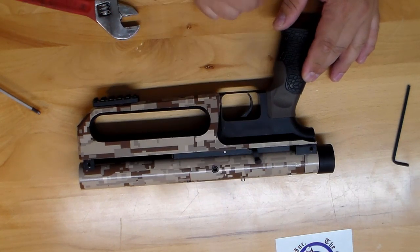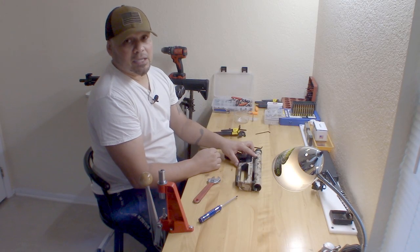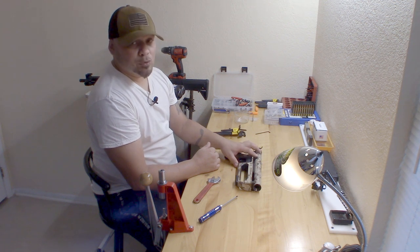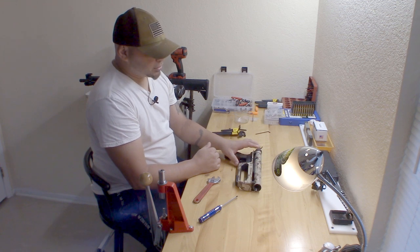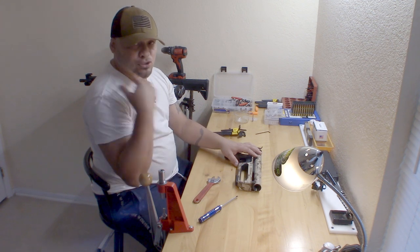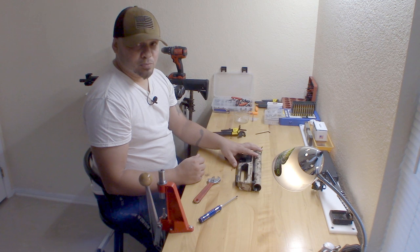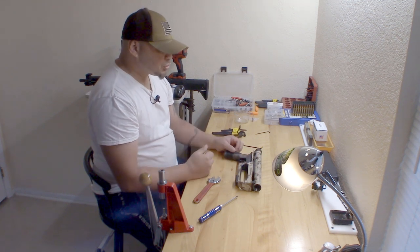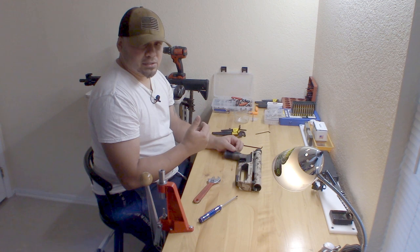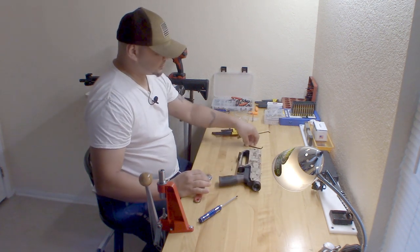Your safety is here - I love the safety because I know when the gun is cocked or not. If the gun is cocked and you've got a round in there, the safety will be activated. If there's no round in the chamber you cannot use the safety, so you know you're not loaded. Some safeties work regardless of whether something's in the pipe or not - I like this one. We'll turn it over and repeat the process on the other side with the same 1/8 inch key - remove these side plate covers.